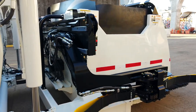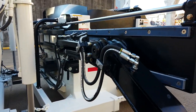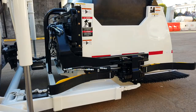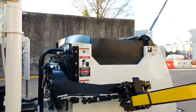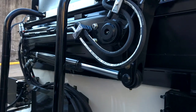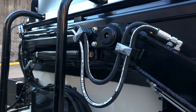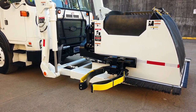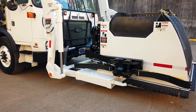Pre-trip cylinder cushion check. Fully extend and retract the slide to check the cushion at each end of the stroke. Then fully cycle the dump cylinder and check the cushion at the top and bottom of the stroke. The correct cushion is 1 to 2 inches, with the cylinder coming to rest softly at the end of the stroke. This internal cylinder cushion will ensure that the dumping mechanism does not slam at the end of each stroke. Check the grip cylinder cushions on grip extend and grip retract. There should be 3/4 of an inch of cushion on both ends of the cylinder stroke.